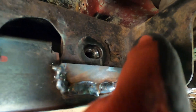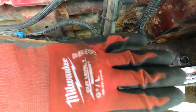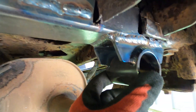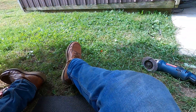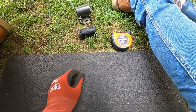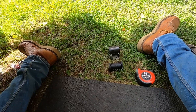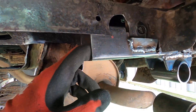I'll fill this, come across here, and will have to grind some of this down. There's going to be a plate covering all this — I'll show you that in a second. I got new WFO Concepts leaf spring hangers — got one of them here, got these off eBay, really nice quality. Got some bushings — those 9/16s and whatever metric size was on here, I think maybe a 14 or 15 — those will match up perfectly. There will be maybe a little bit of slop but it's good enough for this kind of project.